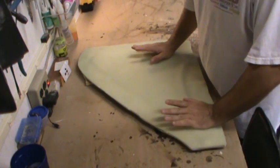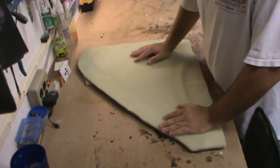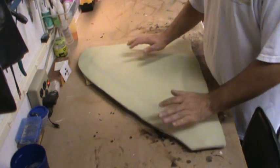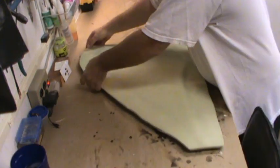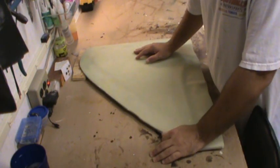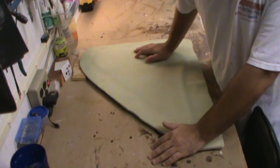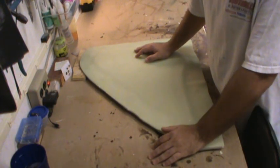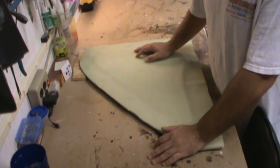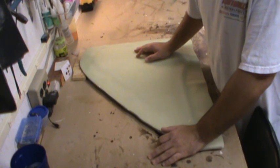Both horizontal stabs are now completely molded. I haven't opened this one since I did the other half — since I kind of left you guys out of the loop on the first one, I figured I'd show you the second one. Both stabs and the one rudder mold are done. Tomorrow on Labor Day I'm going to get started molding the windscreen plug mold and the canopy mold, and possibly the nose cone. I counted — I'm going to have probably around 26 to 28 molds total for this airplane. That's counting the fuselage as one big mold, which will actually be a minimum of four and probably up to ten separate parts.